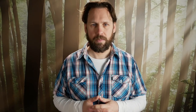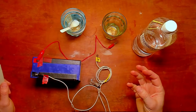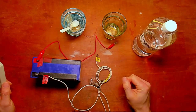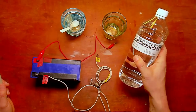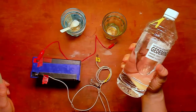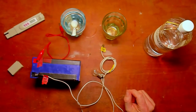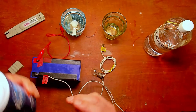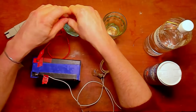I'll now show you that pure water isn't conductive with a simple test. Normally water isn't conducting — it is the stuff inside of water that makes it conductive. This bottle is distilled water, which is pure water — nothing is in it. This is tap water, and I'll make it a lot more conductive when I add a teaspoon of salt and stir it in.